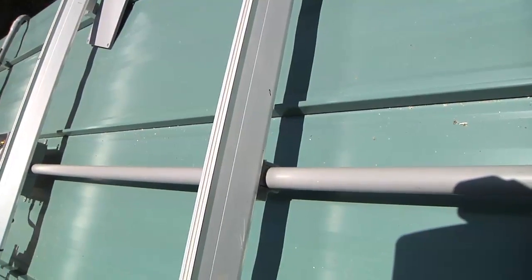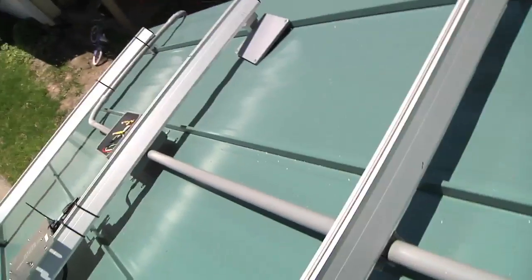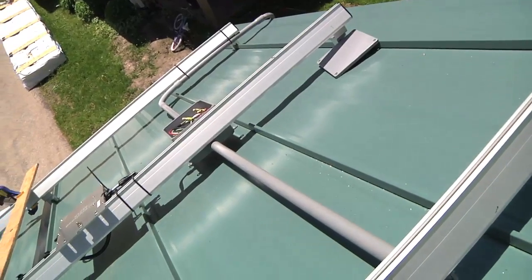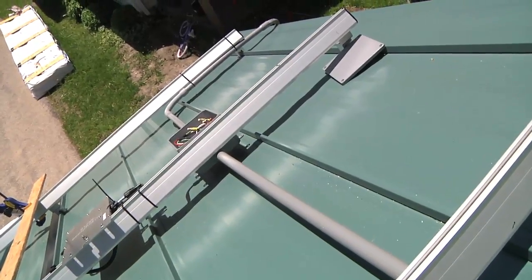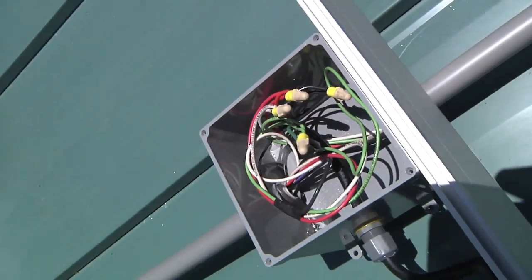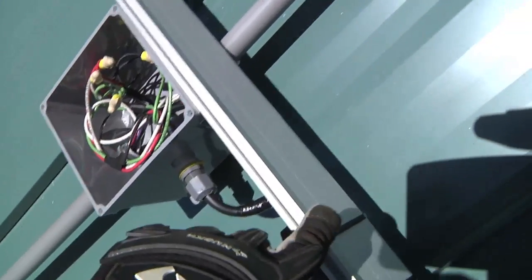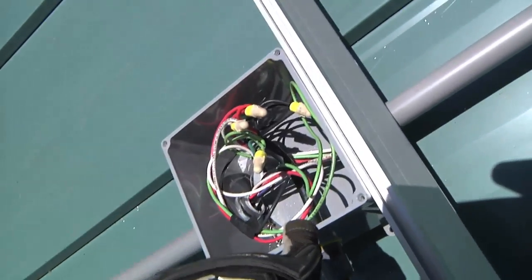So it's three-quarter-inch conduit, except now it has two 240-volt circuits running through it. And then at the bottom box, the one circuit connects in parallel — just wire nuts, nothing fancy — to the bottom row here. Now here in the bottom box, this doesn't look quite as clean because this is where we're doing all the pulling of the cables from and to. Here is from the end microinverter in the row into the box.